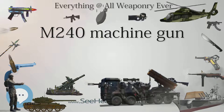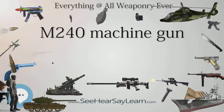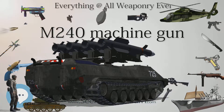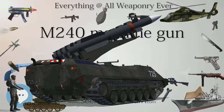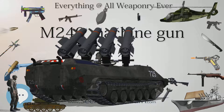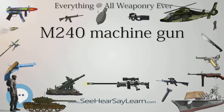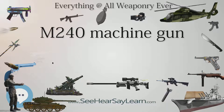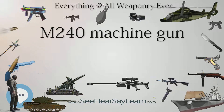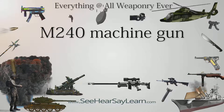The barrels can be exchanged rapidly thanks to a barrel release button on the left side of the weapon. The weapon is cleared first, the button held down while the barrel's carrying handle is moved from the right side to the center, unlocking it from the receiver. The new barrel is inserted and the carrying handle shifted to the right, locking it into place. Headspace is set by counting the clicks as the barrel is locked down, and should be between 2 and 7 clicks. During prolonged firing, care must be taken to avoid contact with the weapon, as barrels can become hot enough to inflict second-degree burns instantly. These hot barrels glow brightly to anyone using infrared-sensitive optics such as night vision devices.